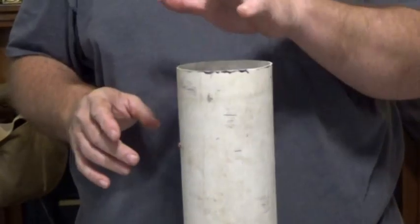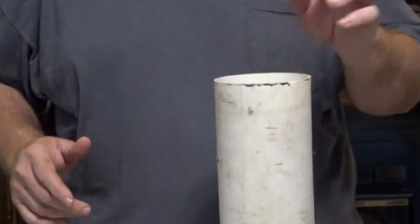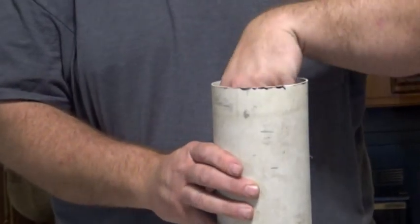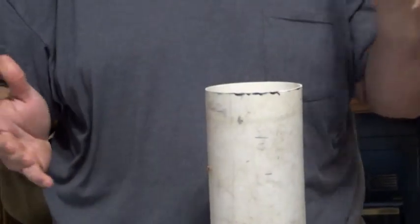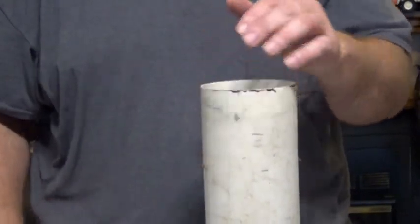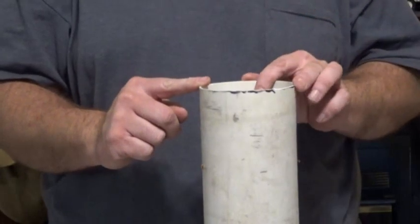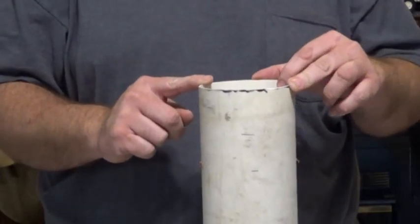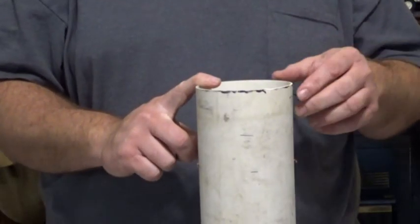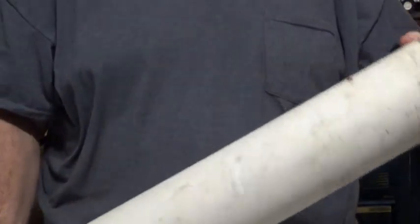And there again, if you're somewhere where you know that your well is smaller than that, a 3-inch pipe or casing or whatever, just get you a smaller pipe. You can do whatever. You can even use the thick wall 4-inch if you want, which is the Schedule 40 water pipe. It don't matter. It's just heavier. That's the only difference. This is good and light when it's done.